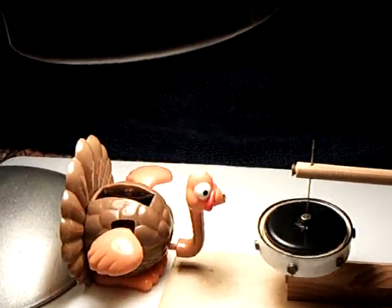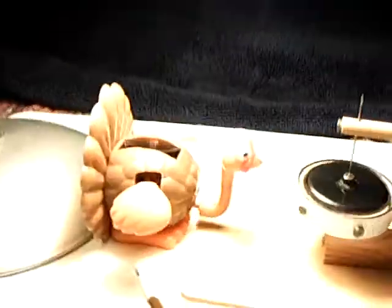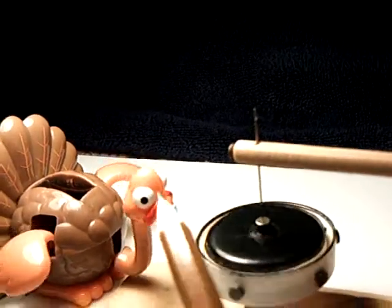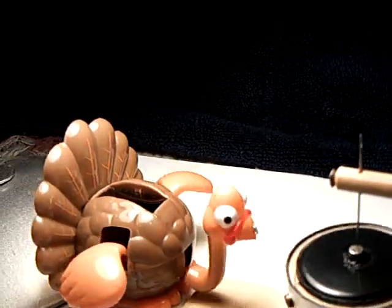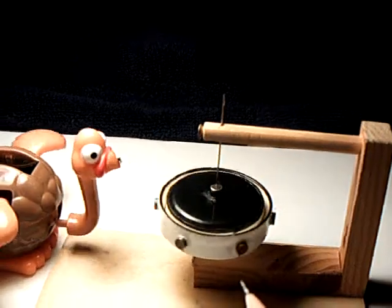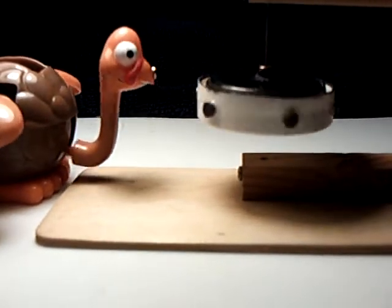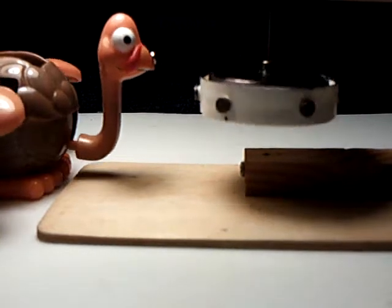What I have here is one of these solar waving toys. The lamp is operating it with that solar cell. And on the tip of the nose of the turkey, right in there, is a little magnet — a little neodymium magnet. And as that turkey does its thing, it pulses this rotor. The rotor is suspended on a needle, and that magnet goes up and down at just the right time to make that rotor go around.